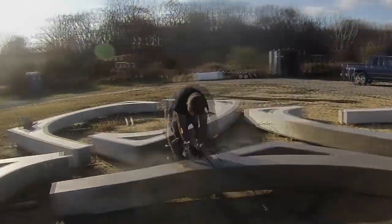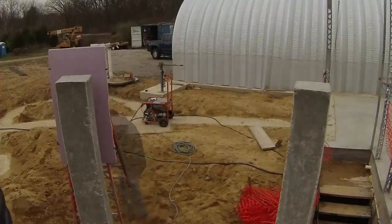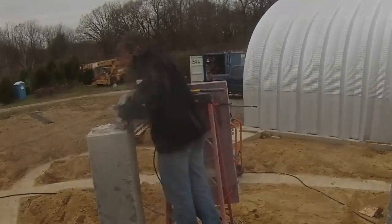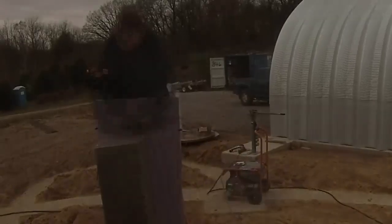Once those were flipped, it was back to polishing the other side. By now, I'd also poured the kitchen rib columns, and the forms had shifted and lifted while we were doing that, so now I needed to shave off an inch to get them right again. I ended up cutting around the edges, then chiseling off the middle, and then polishing it down to the final height.